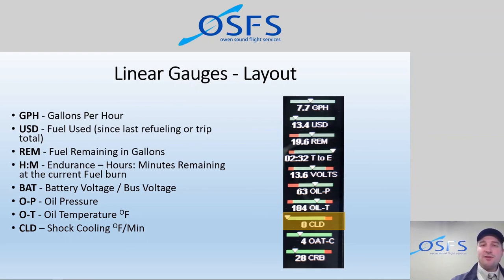So this is measured in degrees Fahrenheit per minute. And Lycoming, who makes our engine, the O-320-E2D, most Lycoming engines, they'll even recommend about 50 degrees Fahrenheit or 60 degrees Fahrenheit per minute of a change. So when we're doing flight training, we're practicing stalls. You know, we're up at 3,000-4,000 feet where the temperature might be kind of cold, and we're making a power change from generally cruise power to idle power.